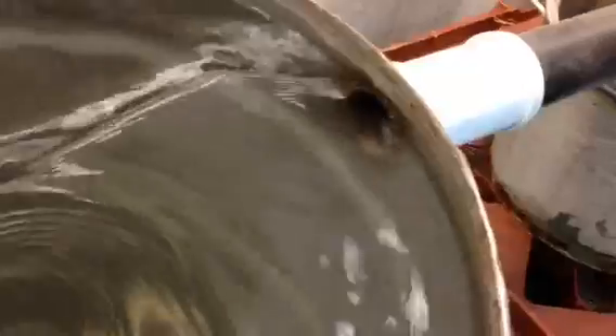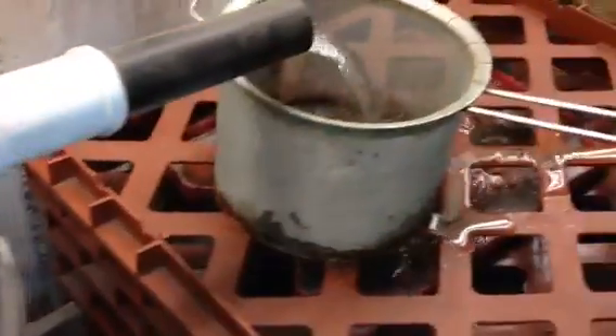The water tank has a whirlpool. The idea behind this is that the heavier copper, if there is any in the plastic, will go to the centre of the whirlpool and get washed back into the aluminium tray for separation again. The lighter plastic and the dirt will go to the top and out of that outlet into the water filter.